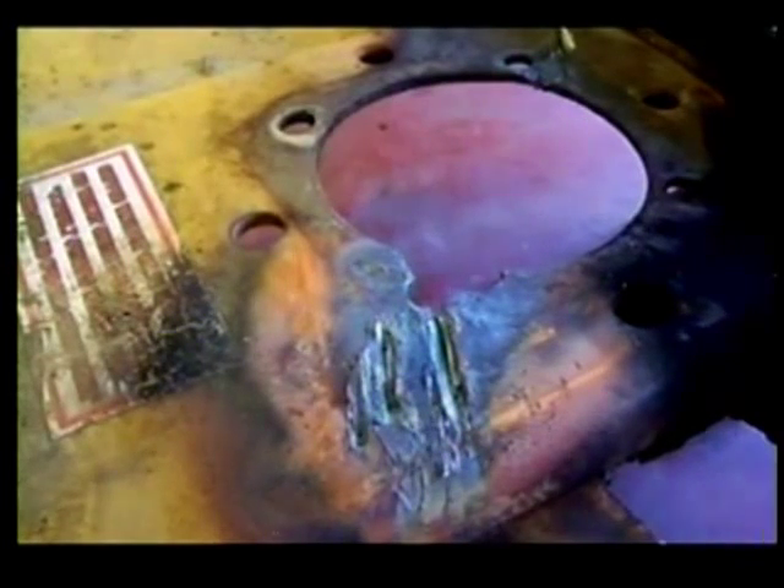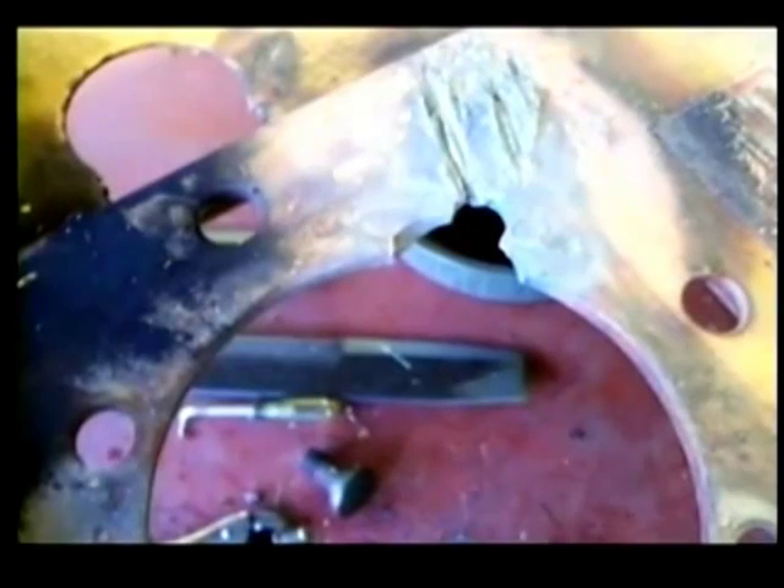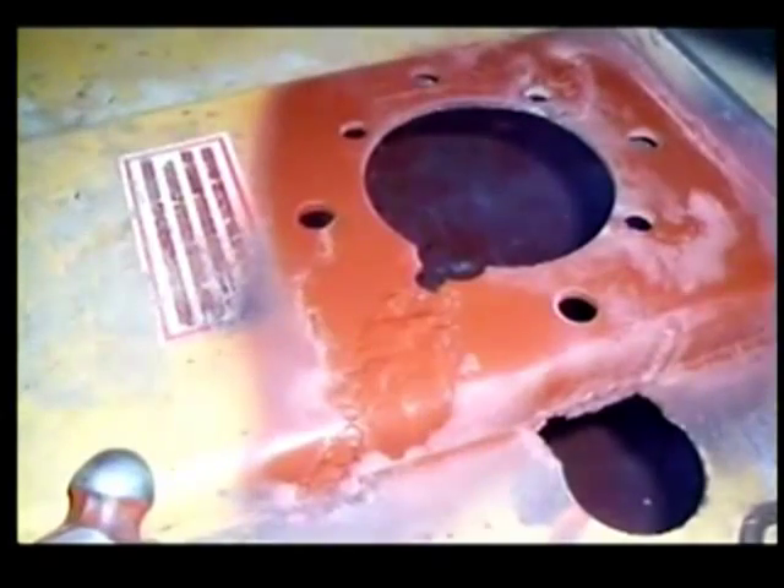On this King Cutter Bush Hog, there were a lot of cracks that had been welded over that I had to redo — had to re-weld. The flange where the gearbox bolts to was warped and had to be straightened. Now it has been straightened and painted, ready to bolt the gearbox back down.